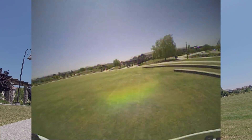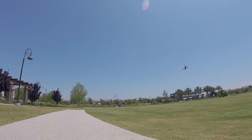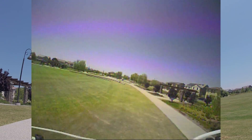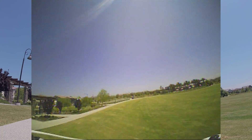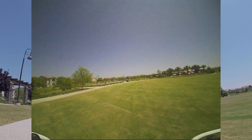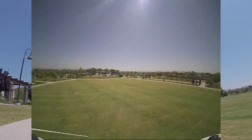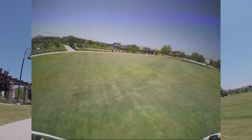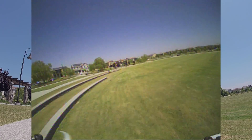It really comes down to these 1106 6000kV motors. If you're doing a build I'd definitely suggest looking into these. They were about $7.89 last I checked — they went out of stock and came back, and I bought a few more sets and told people on Facebook to grab some. They're probably out of stock again until around end of June, but when they come back I'd highly recommend them: a pretty inexpensive motor with really good power even on 2S. If you're thinking about MultiGP builds on 2.5-inch props, this is a good cheap motor to get.